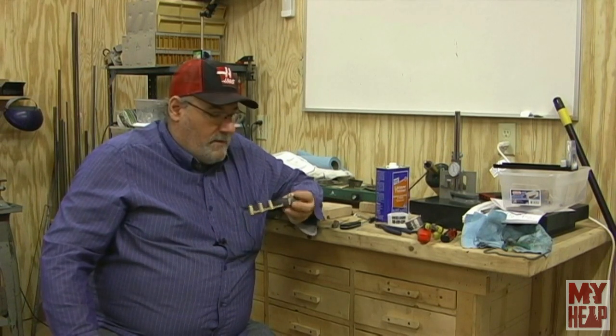Well, the fuel tank and the supply pipe and the wick cups and the bottoms and everything, the fuel inlet, our fill tube, has all been soldered in place, and I checked, it's watertight. It's going to need a little bit more cleanup, simply because I got a little sloppy here and there, but I'll do that on my time and off camera, and I'll get it painted up and everything. But probably we'll try a burner test anyway before I do all that, a wick test, because I got some ideas that I want to try out.